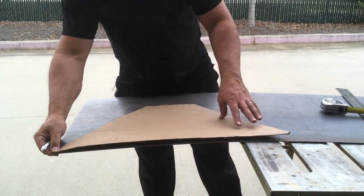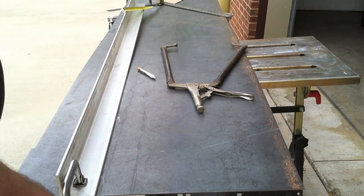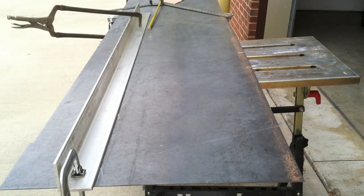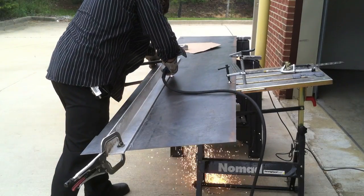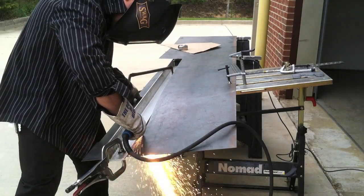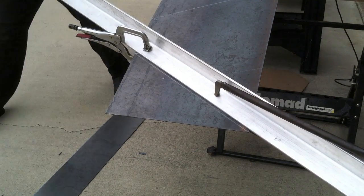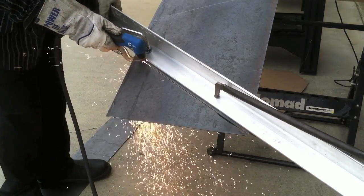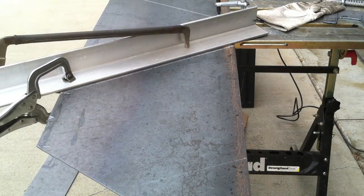I'm using 16-gauge hot-rolled steel. I rolled a little portable welding table outside because I'm plasma cutting — I don't want to sweep that stuff up. That's part of the reason I want this table, so I can lay something on it and cut it and suck all the smoke out, but I don't have it made yet so I'm pulling it outside. I don't have a shear — I'm not a sheet metal shop, just a job shop — so a plasma cutter is the next best thing. You can make a nice straight cut without warping on sheet metal using a long straight edge; I'm using a piece of aluminum angle. About five-sixteenths offset is right for this Miller tip. I'm using a Miller Spectrum 625 Extreme plasma cutter set at max amps with a drag tip.